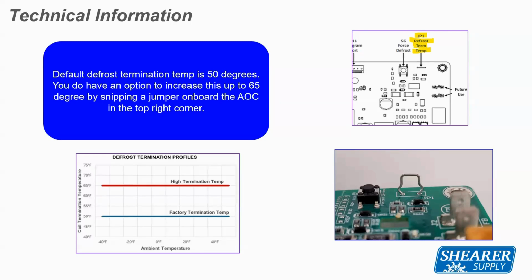Now let's talk about it in heat pump mode. The idea is the same. If it's mild outside and I'm running in first stage of heat pump mode, I am going to decrease that compressor speed by a couple percent. In the same essence, if it's super cold outside, I'm going to increase my compressor speed on that Y1 call by a couple percent and try to satisfy it there. Some of our competitors are actually changing that compressor speed by suction pressure. We are not. We are changing our compressor speed based off of the outdoor ambient.